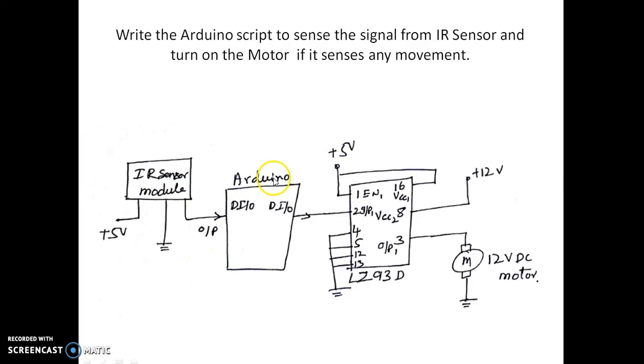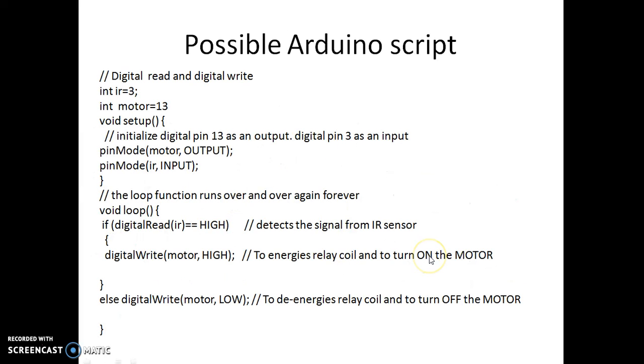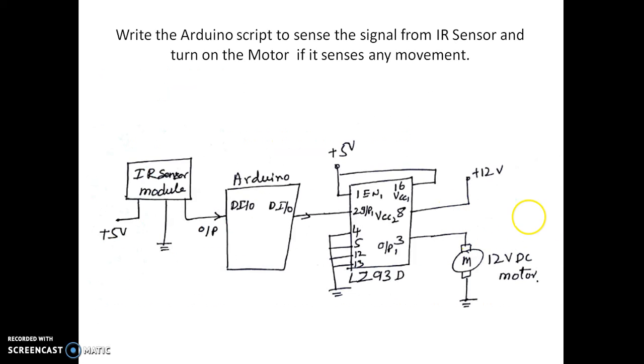If you are asked to drive an AC motor, this output can be connected to a relay coil. The NO, NC, and common contacts are appropriately connected to the motor, so that the motor rotates depending on the signal available on the input. The relay energizes or not, and accordingly the motor runs. That is the easiest way of doing the experiment.